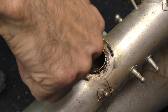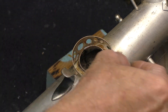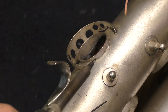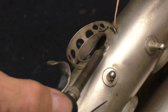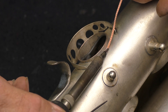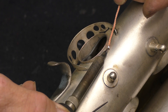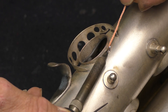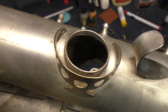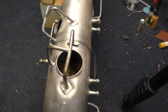I think we've done it. Let's cut the wire away here and see what we ended up with. Going to clean up the area with a little bit of steel wool. This turned out pretty well, other than a little bit of excess solder I can get off with some solder wick. I'll warm it up with my soldering iron and let the wick suck up that little bit extra poking out on the outside. I'm pretty pleased with that. I don't think there's going to be any leaks — I can see the solder joint all the way around. That one's done.